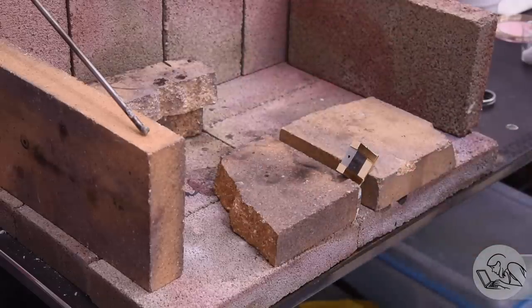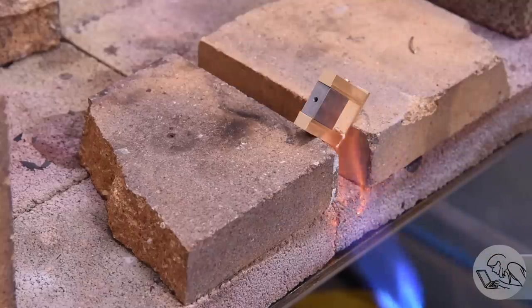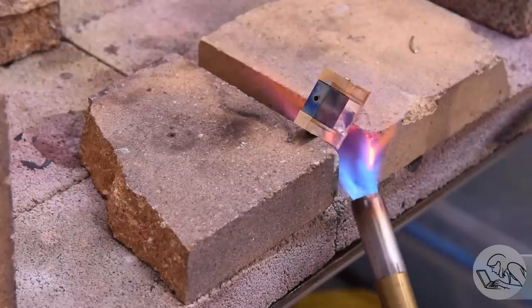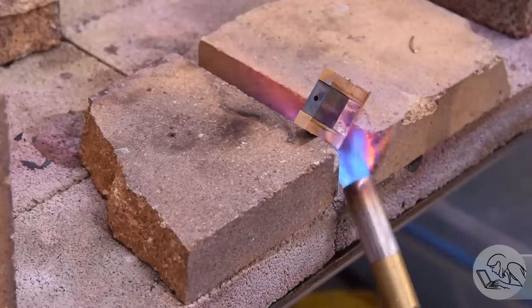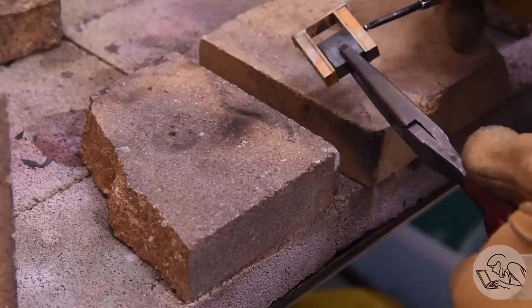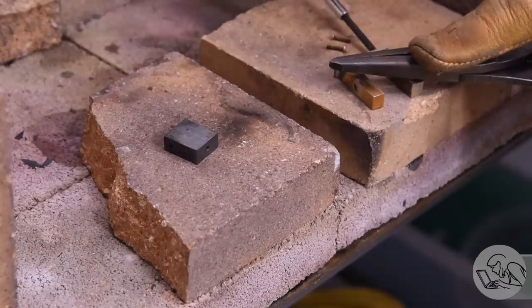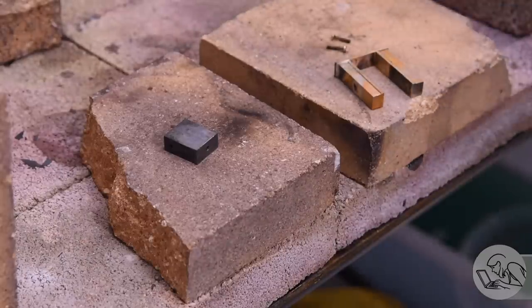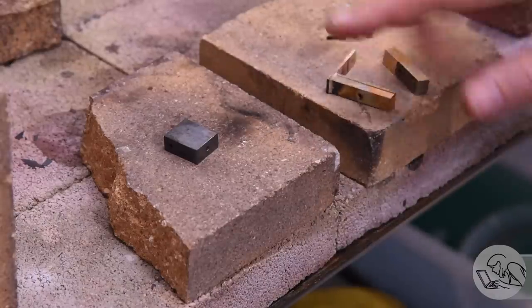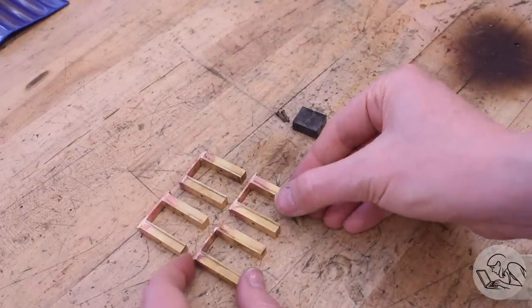This is the classic Kozo method and I'm going to stick to it because he knows what he's doing. Doing it with this angle helps ensure the solder flows down into the joint with the help of gravity. It is more labor intensive — after each joint you have to take everything apart, and the other two pieces which were effectively placeholders then have to go back in the pickling acid before you can do the other joint. You also have to disassemble everything because that fixturing block cannot go in the pickling acid — it's made of steel, and you don't want anything ferrous in your pickling acid because that will contaminate it. With all eight joints done, I now have the four arch structures ready for the next set of finishing operations.